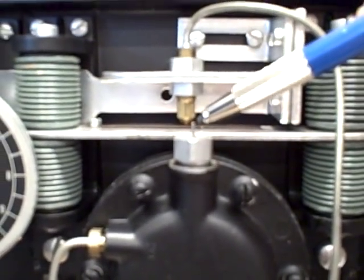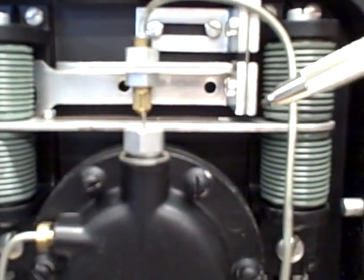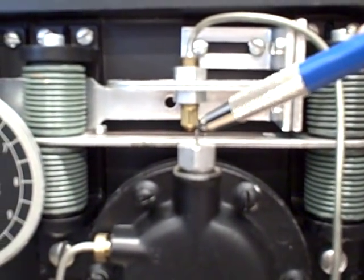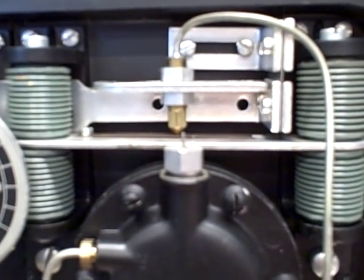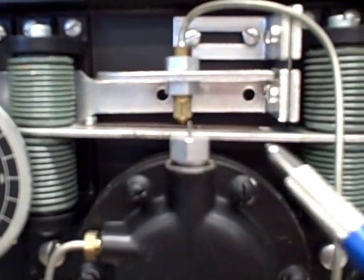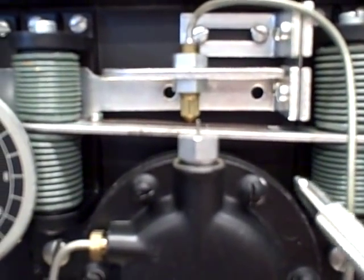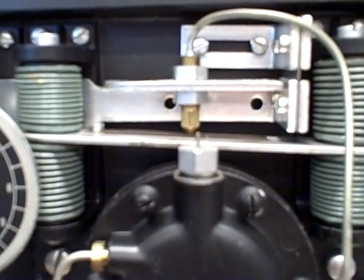This is a great example of a motion balance instrument because the motion over here is balanced by motion over here to keep that gap constant. Go ahead and apply a pressure there and we'll watch this go up on the left and down on the right. You can see this bar now is taking a tilt to it. The left-hand side is going up, the right-hand side is going down because that's what is necessary to keep that gap constant. That is a motion balance instrument.